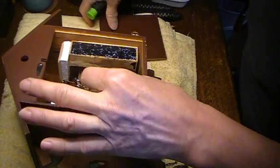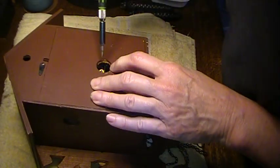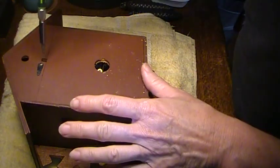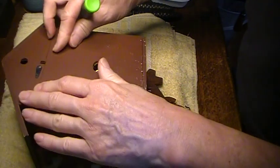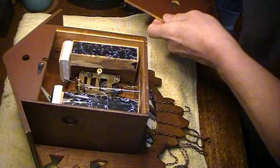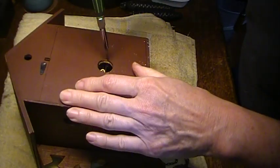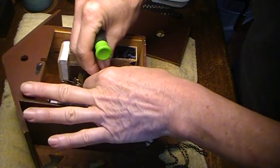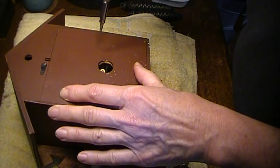So having a cuckoo quail clock that had no holes in it and I had to adjust through the sides made me learn in a hurry where these things needed to be. So I'm about a millimeter above the gong. And you can hear how it's just sitting on it and dampening it out. I'm going to go back up a little bit more. I'm too far forward. It's not hitting it at all. Pretty close. Pretty close. There we go.